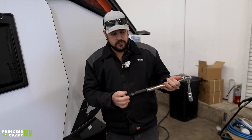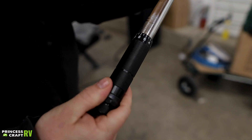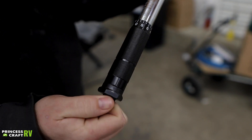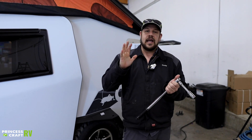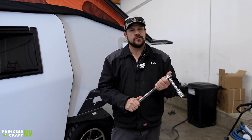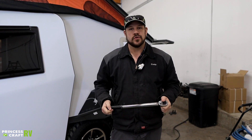When you're done, loosen this back up. Turn your handle all the way back down to the bottom, which is going to be 10 on this torque wrench. Snug that back up and put your torque wrench back in its case. This is a calibrated tool, so you do not want to store it at the torque value of 100 — it will eventually throw it off. Always put it back to its bottom setting, put it back in the case, and that's it for using a torque wrench.